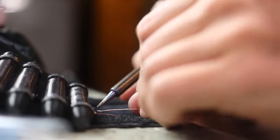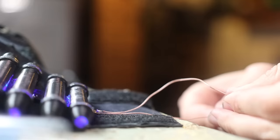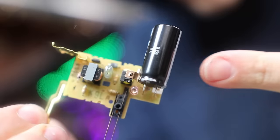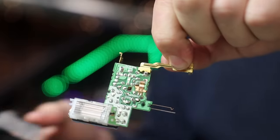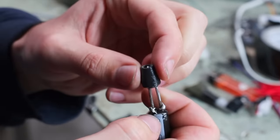Not sure if this is built into the same bracelet, but for this one I'm gonna build another bracelet for my other wrist. We'll use the same light method as the previous one — print out more tubes and stick some lights in them. Here's how we're gonna make it shoot electric darts: I took a disposable camera and harvested the capacitor. This thing powers the camera's flash but puts out a powerful shock if you short the terminals. I also took out the charging circuit to integrate into the bracelet. Then I built the capacitor into a dart with two metal prongs at the tips, each connected to the leads of the capacitor.